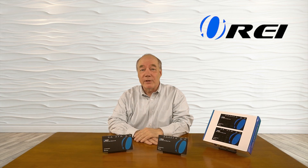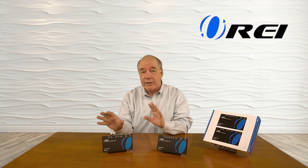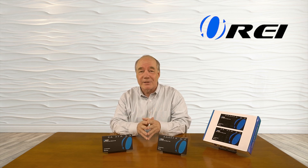We hope you found this overview of the UHD EXB-132AR-K helpful. With a few simple connections, you can use this product to extend any 4K ultra high-definition media source up to 230 feet away in your home over a single cable. You can also use the infrared blaster kits to extend infrared signals from that secondary location all the way back to the primary location over that same cable so you can control the media you're watching. Because the product includes the newest HD BaseT technology, your video and audio signals will be transmitted across that LAN cable to the secondary location in crystal clear clarity. If you have any questions, please check the FAQ on our website or use the contact us link and we'll get back to you as quickly as we can.